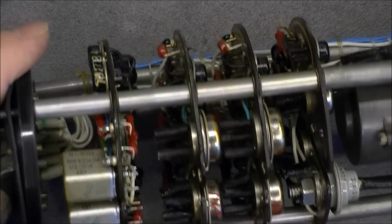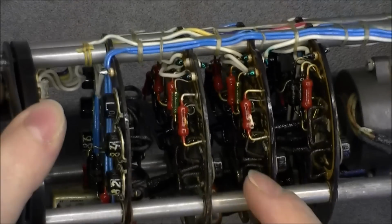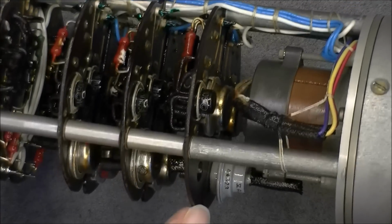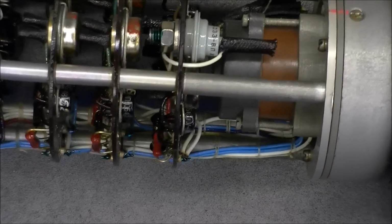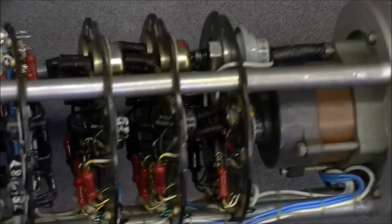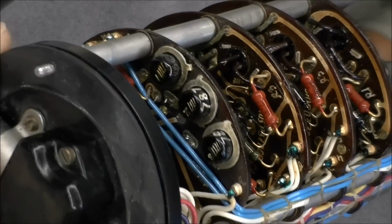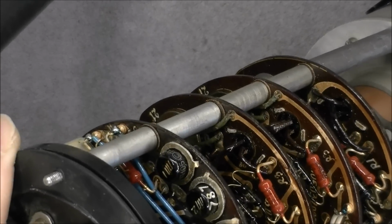So second and third layer of PCBs, they are the same, in fact 4 times the same thing, with 1 big transistor, 2 smaller ones, and resistors and diodes. Do you see it? Yes. Same thing here. And on this one we have another almost similar stage than this one, but there is an unpopulated hole here. And here we have one big metal can diode and more transistors all the way around. You can see already really nicely attached wires here on these rods. There are lots of handwritings on the PCBs. You can see the transistor part numbers are handwritten with some white paint.